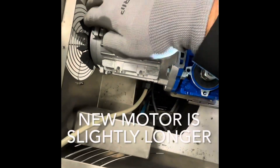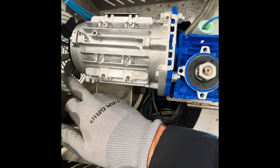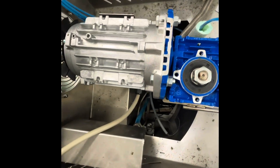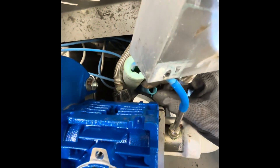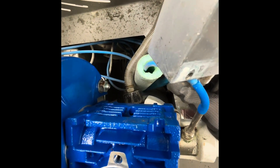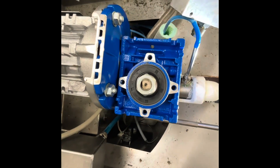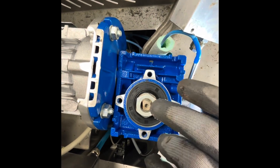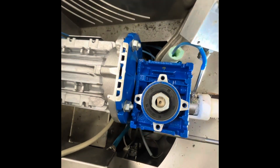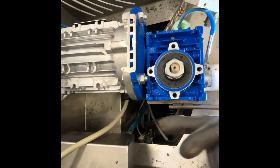I had to twist it and go up and down to fit the motor, and I ended up taking the end bell off. I'll pull this screen out to get the end bell back. I've got some new tubing too because this glycol tubing is totally deteriorated. Next I'm going to get the set screw in — this has a critical torque — and then set screw it so it doesn't spin. This wire I'll feed down and through into the panel.